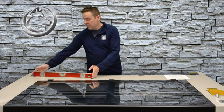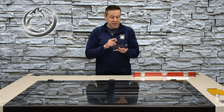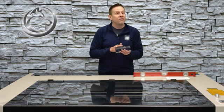During this first part of the leveling we saw that I was using this construction level. If you're starting out and you don't have any level at all, I recommend just buying the machinist level — you can still do this leveling with it. Just know that having the bubble anywhere in the middle is going to be close enough for this first step.